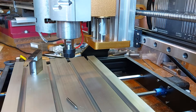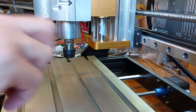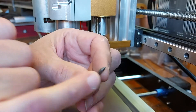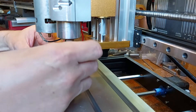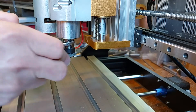So I'm just setting up this little CNC, the Genmitsu 3018 Pro mini machine. I'm just trying to get it square and the table flat. First, table flat. What I've got is a little pointer — this is an old carbide cutter that I've ground to a point and then rounded the point. I don't want a sharp point, I want just a rounded point. I'll put that in the tool holder there and tighten that up because I don't want it to move.